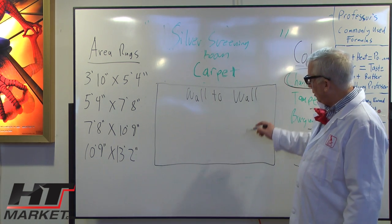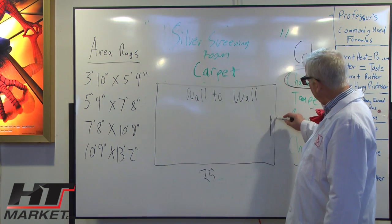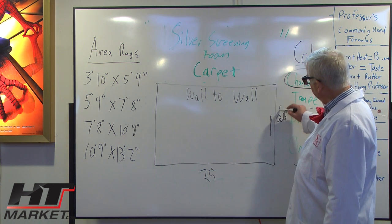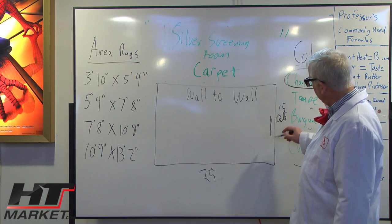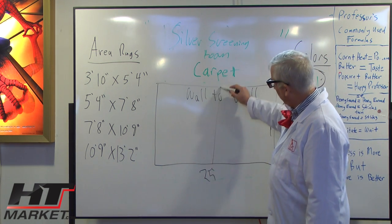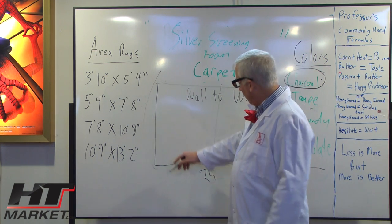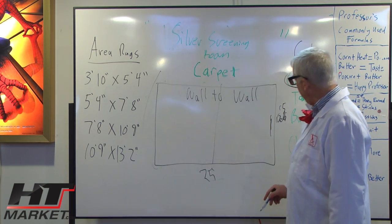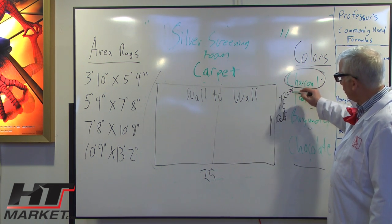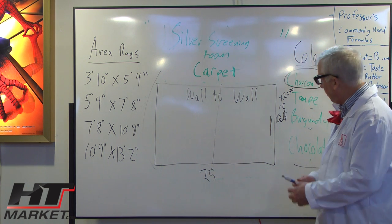Generally you're putting it on the floor. So say you have a 25-foot room with a screen over here, and say you have a 15-foot room — you'd run your 13.5-foot width this way, across one way and across again. So you'd have 27 feet and you just overshoot by 25, meaning you'd buy a 13.5 by 30 carpet. You're taking the small dimension and multiplying it by two to get the proper size carpeting.